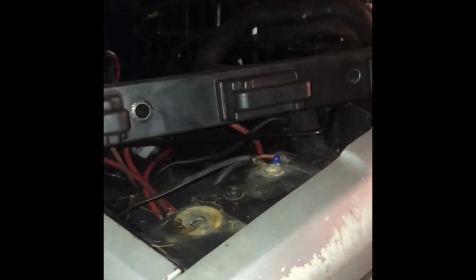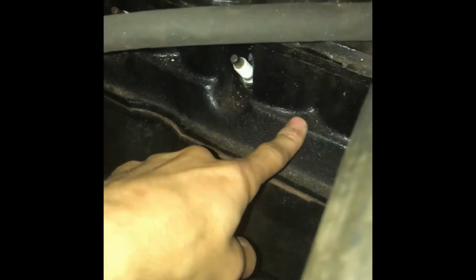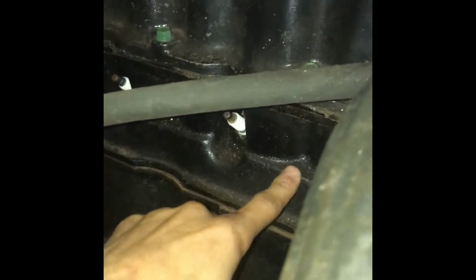Okay guys, so I'm going to make a coil pack mount. The coil pack sits right on those spark plugs, and since this is a 2000s and up coil pack, they had bolts going through here, and right in the center there would be a threaded piece where the bolts go into and mount it. But this is an '87 head, which doesn't have that there.